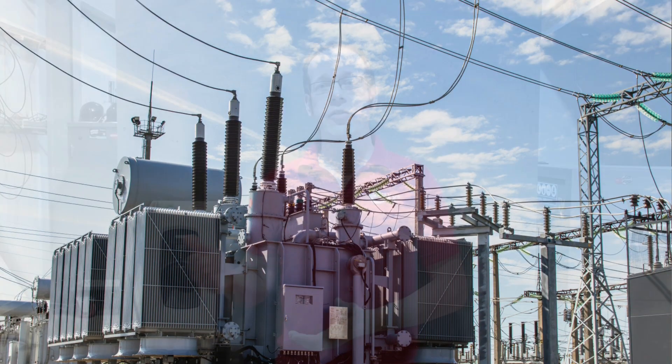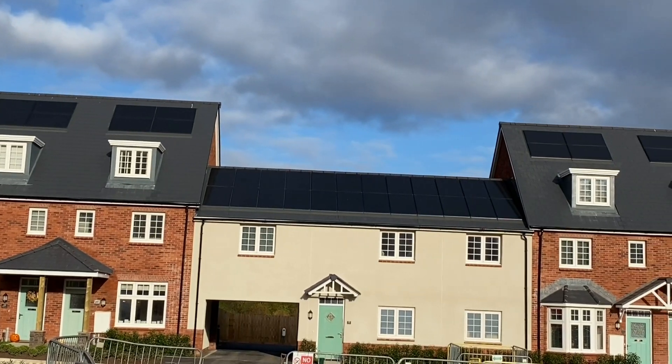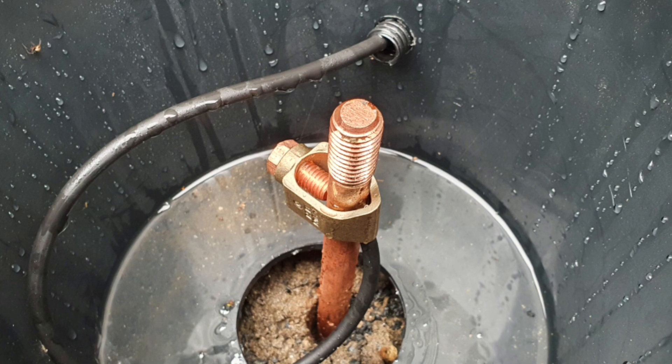It's also possible that the voltage may be too high to the property. This can depend on factors including how close you are to the local transformer, whether the taps on that transformer have been changed due to loads being added to the network locally, or whether there are any renewable sources of electricity operating nearby. If it is exceptionally high or low, the local DNO can be contacted and they will often place a monitoring device on site — or using data from Indra — and make a decision whether to lower or raise the voltage by altering transformer taps locally. If voltage measurements show the supply voltage is too high or too low and there's no other indication that a proper PEN fault is occurring, then it may be that the method of complying with Regulation 722.411.4.1 is not suitable and an earth reference electrode is required, with the charger set up to use protection method A, which is the recommended installation method as it offers the best protection.